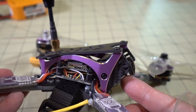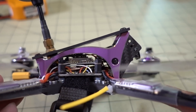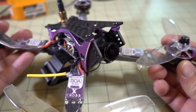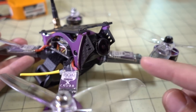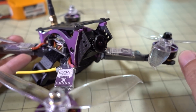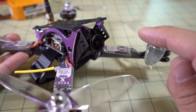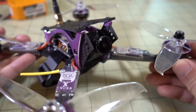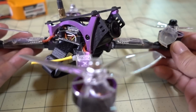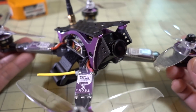I also made a change to the camera because I couldn't get any up-tilt on it. There was a little piece on the back hook preventing me from tilting the camera up, so I took it apart and cut that off. But I ended up moving the camera back down anyway because the field of view on this camera vertically is really narrow — it's a 16x9 CMOS camera. You'll see in the flight demo that this camera will limit you as a racer. I'd recommend something like a Foxeer Predator with a large vertical field of view for a better racing experience.